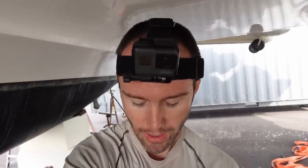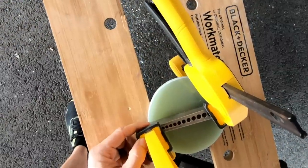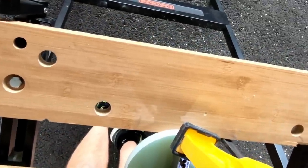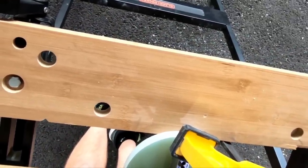Drilling and tapping for the machine screws requires straight holes, which is impossible to do just by hand. So I found a drill guide for all different sized drill bits — I can center it right over the mark I made on the backing plate and have a much better chance of actually drilling straight. With one hole drilled and tapped, I want to do my first test fitting — screw one of the screws from the seacock down into the backing plate and make sure the other drill marks line up where they're supposed to. Measure two million times, cut once.